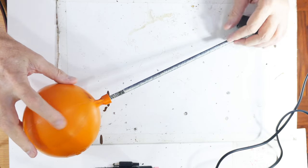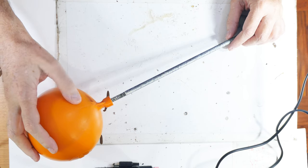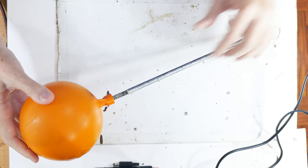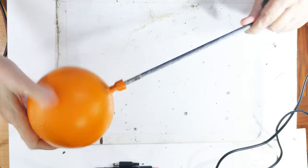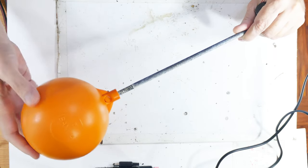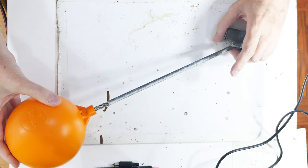Some basics. If the ball has any water in it, it's toast — it's done. I tried to repair them when they were copper, tried resoldering them and all that. Plastic is not worth it. You want to make sure they're screwed on here pretty tightly without puncturing the ball, so you just give them a twist. If the ball comes off during the motion going up and down it'll sometimes unscrew itself, and if that happens the valve opens and you lose a lot of water — it won't shut off by itself.